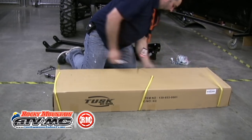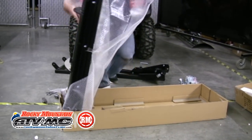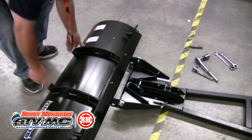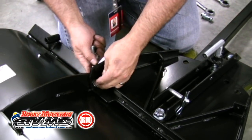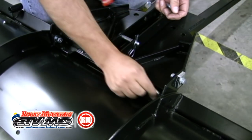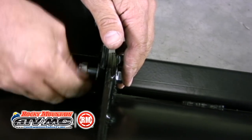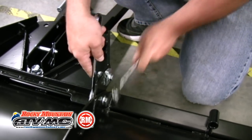Now let's move to the blade. Open up the box, pull out the packing material, and lay the blade flat on the ground. Inside the box there's a box of hardware — these are the skids that come with the blade. Lay the blade up next to the push tube to assemble them together. In the hardware kit, you'll find two bushings that fit inside the push pivot hole where it mounts to the blade — go ahead and install those. Then install the M12 by 35mm hex flange bolt through the blade and push pivot, and install the washer and lock nut on the backside. Tighten those up on each side.